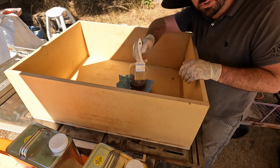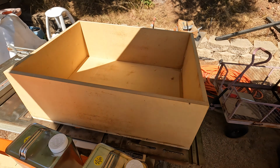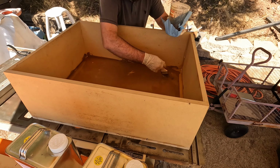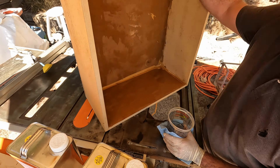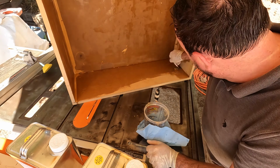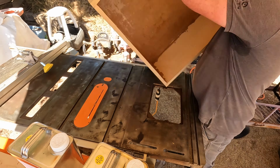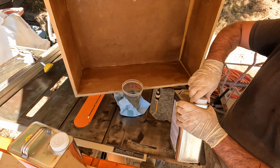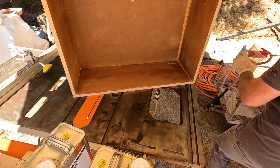There. All right, y'all. We're just gonna get a chip brush. And here we go, y'all. We are applying the epoxy. We want to get it soaking in gently, so we're doing some light coats. This has a pretty long cure time, so it's easy to go back over and get some extra density in there. This stuff is very thin, and it's designed specifically for soaking into wood, which is exactly what we're aiming for on this one.